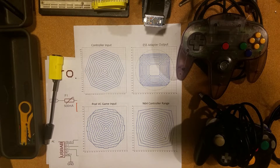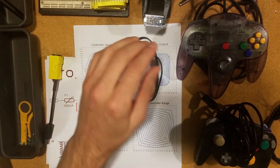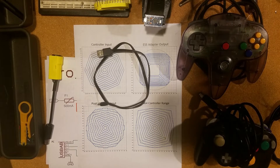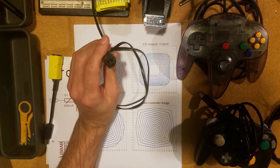We need to talk about powering the Arduino. The simplest, easiest, straightforward method that always works is to just power it through USB — whether you plug that into the back of the Wii or into your computer, you'll never have a problem. If you don't intend to use the input display, or you want to reduce the number of wires, you can power the Arduino through the 5-volt rumble motor line on the controller.